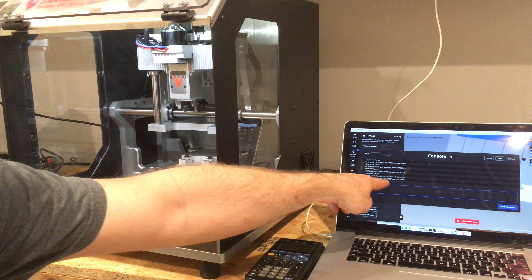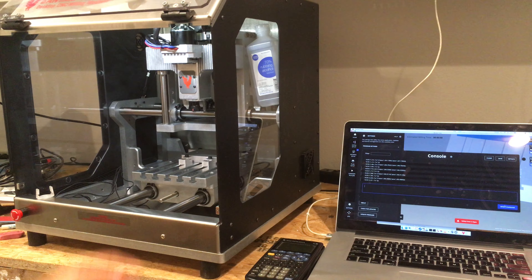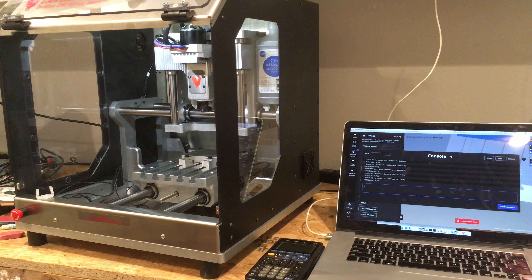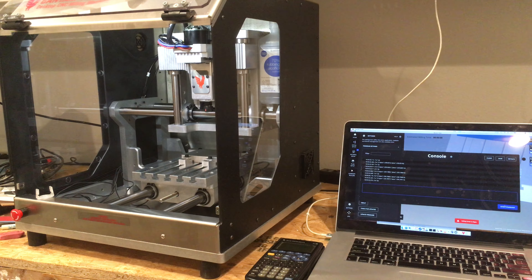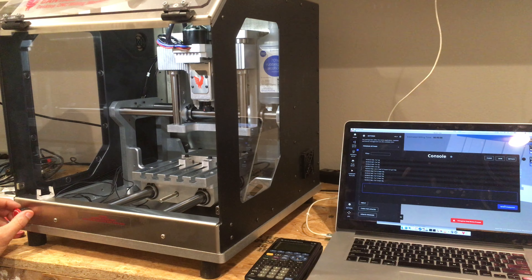We didn't need to home, which is interesting. I can see all these positions being sent back in the console log. That's pretty slow. I'll throw the rubbing alcohol bottle in there — it's not even pushing against the metal portion, just the plastic on the side. At slower speed we suddenly have more torque. It's starting to compress the bottle — actually no, there's just not a lot of torque there. We're losing steps back and forth.